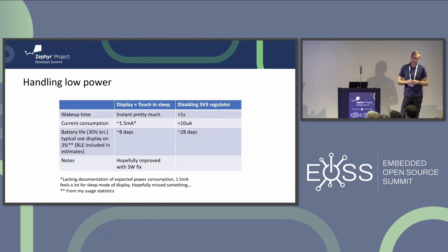The power consumption measured right now: you get around eight days with the display in the less aggressive sleep mode. If you disable the voltage regulator, the PCB and hardware can go into a very nice low power mode. It's also super easy to accidentally break power consumption when coding - a small change and suddenly everything consumes a lot of power. I need to add some kind of automated power consumption measurement so I don't keep breaking it.